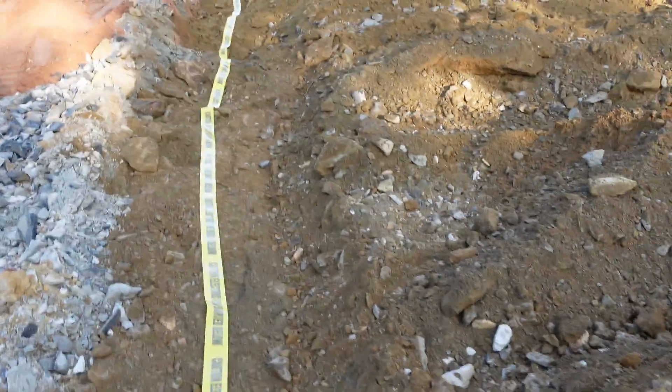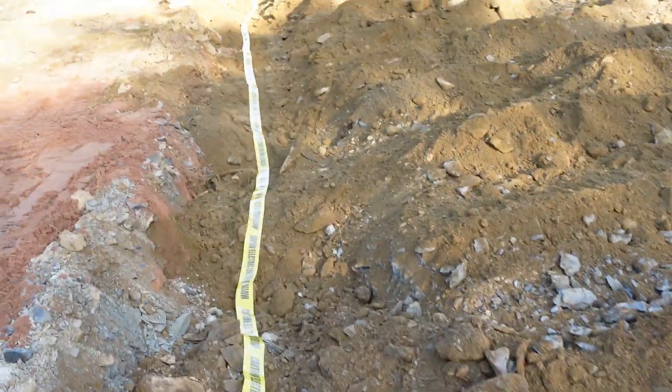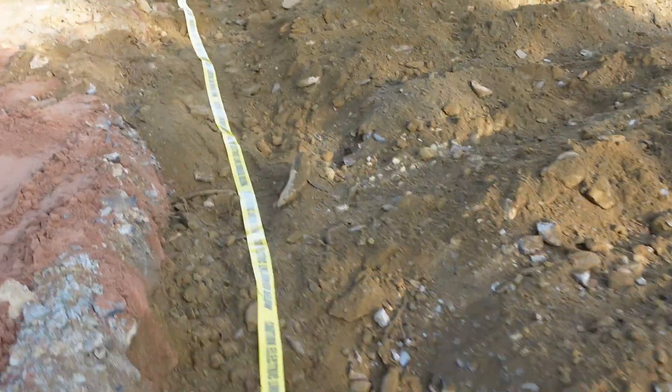The sand is in the trench, then the fill goes over that, and then this burial tape goes six inches down from the top. Then they do their final filling over and leveling off, and that's the end of the trench.